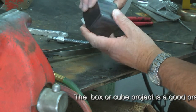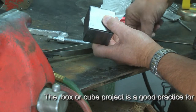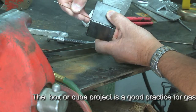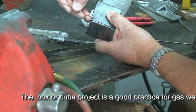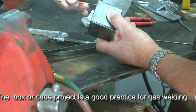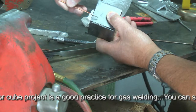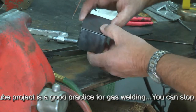Remember, the importance here is that if you're filling gaps, you need to make sure that your filler material is as thick as the base materials if you want the same strength as the base material. Also, this ER70S2 filler rod would have to be as strong as the base metal to produce a joint that's as strong. So we'll go ahead and do that.